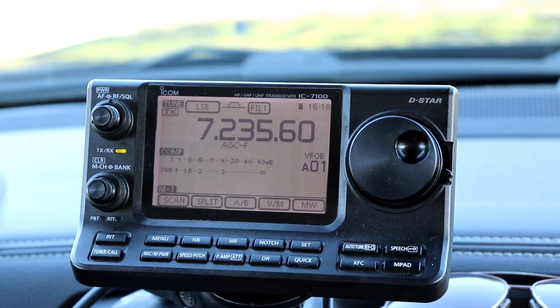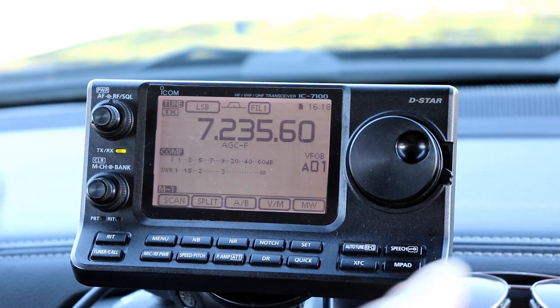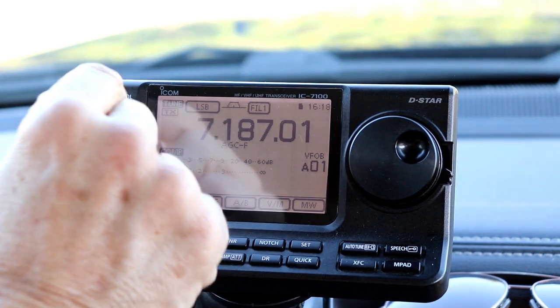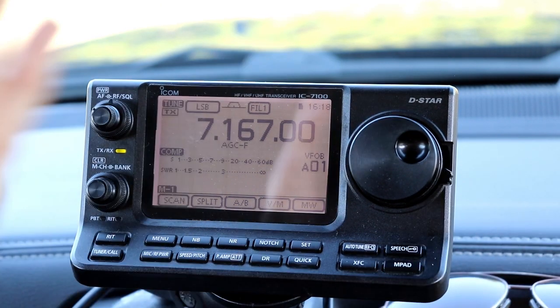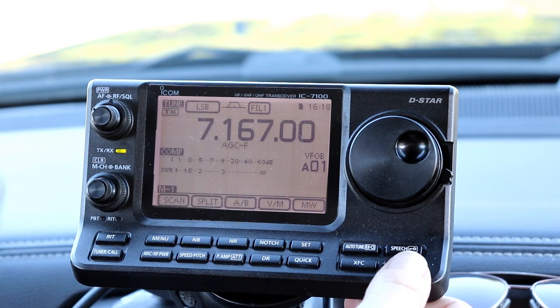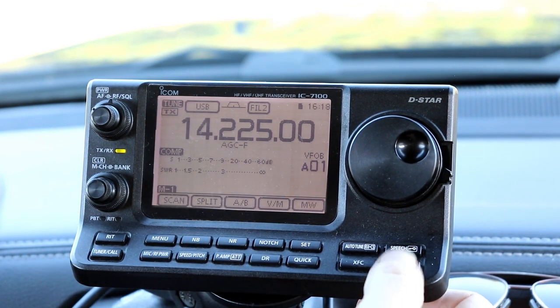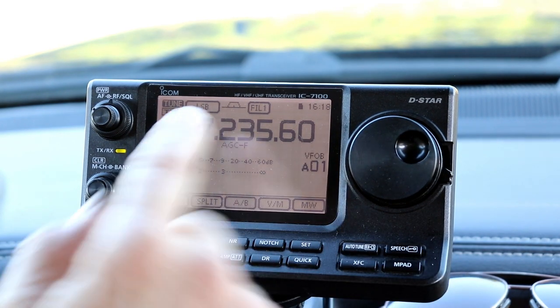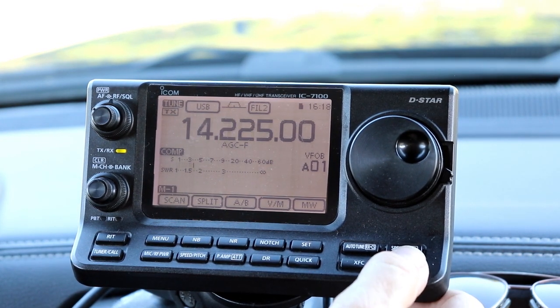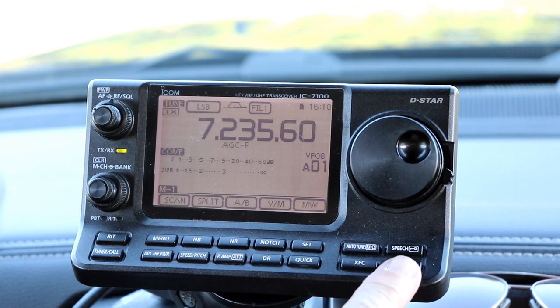So how do you access the MemoPad? That's actually very simple. Instead of pressing and holding MemoPad, you just press it briefly. There was the most recent one, then the one I remembered before that. Each time you press it, it goes backwards through memories to the ones you've recently programmed. And here was one I had programmed earlier on 20 meters, and another one — that's the fifth one. Then it goes back to where I last was. Your current frequency in the VFO is sort of automatically in the MemoPad at all times.